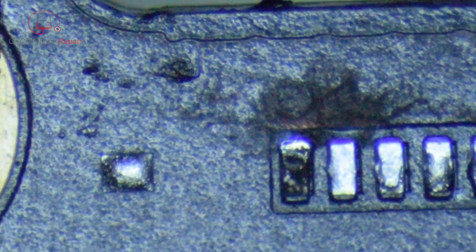I had a tablet I was working on recently that looked just the same. Once that moisture gets trapped under there, all the rice in the world is not going to help you, because we have a physically broken connection and we have corrosion taking place under there, which over time can get really bad — probably to the point where there's no way you can use that particular spot again. I don't think trying to replace these pads is a realistic approach, but as I'm scraping it, the good news is there is actually a pad under there and that debris is starting to come off. Through a process of adding flux and heat, soldering, then wicking it away and cleaning it up, eventually I did get this thing to look healthy enough to hold some solder.